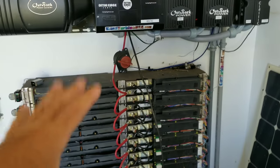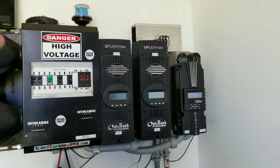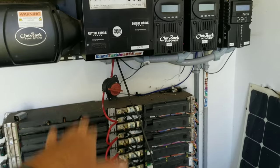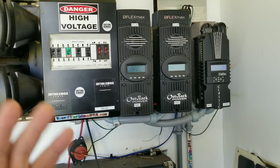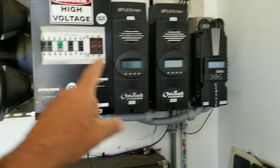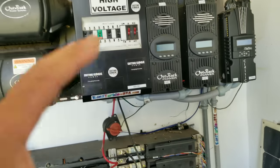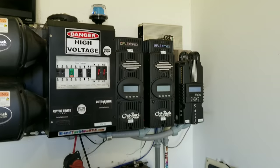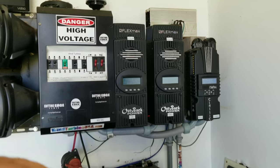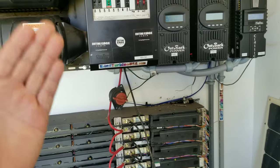The problem is it's pulling DC power directly from the battery, not from the solar panels. The charge controller reads the battery voltage — if I turned on that air compressor right there, it would bring the voltage down a little and the charge controller would say the battery voltage dropped and send more power back in. That system causes micro-cycling on the top end, and if you accumulate enough micro-cycles, you actually add up to one complete cycle of a full discharge and recharge.